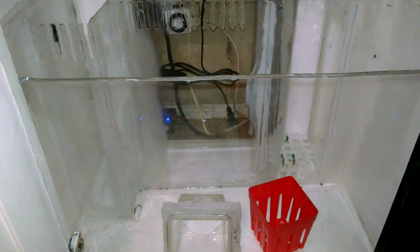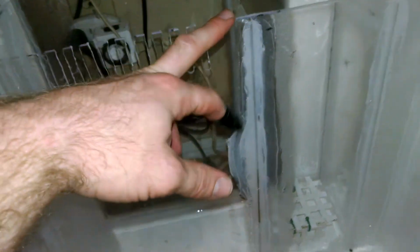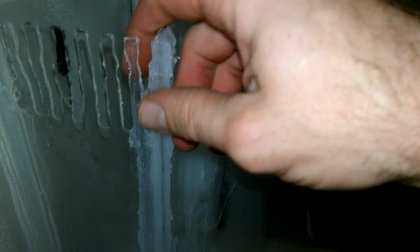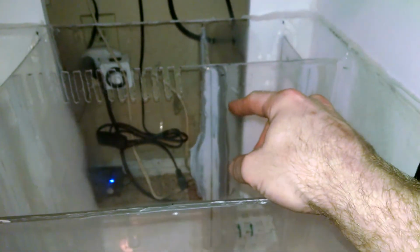Any questions? So definitely remember, when working with plexiglass, I recommend sanding the sides and using a whole lot of silicone. The more the better. This is why it looks like a hot mess. I probably didn't talk about that yet, but yes, the more silicone the better. And just let it cure, and definitely let it cure for a week before actually using it, because of the amount of silicone you're using. So plexiglass, sanding it, silicone will stick to it very well.